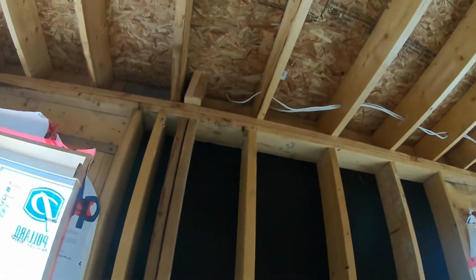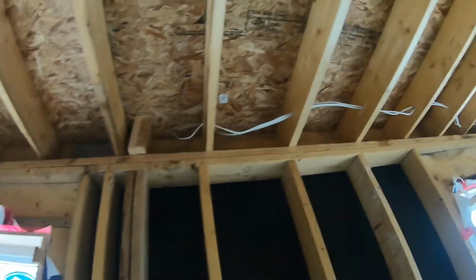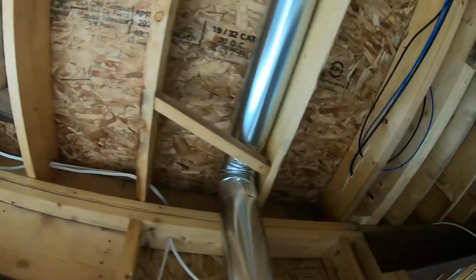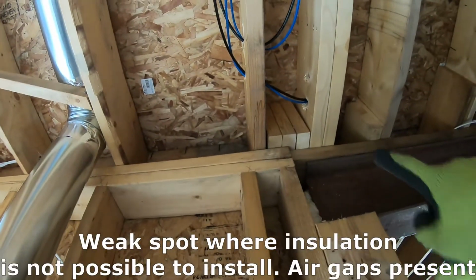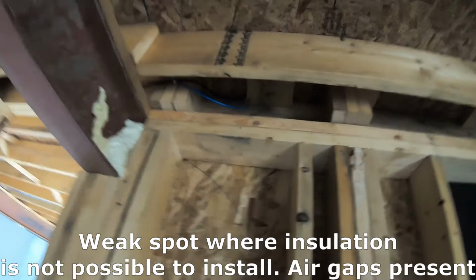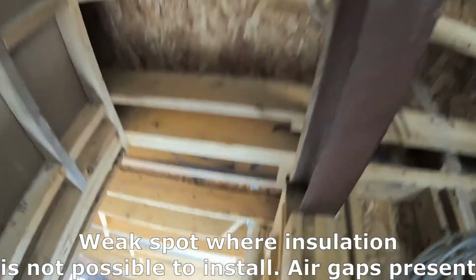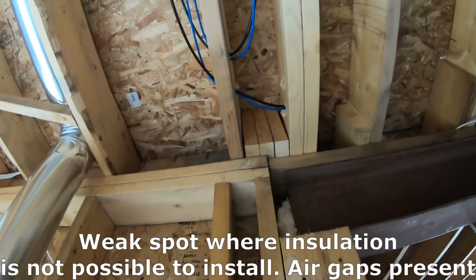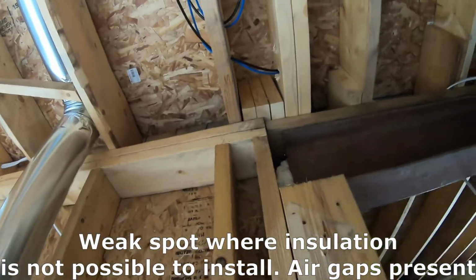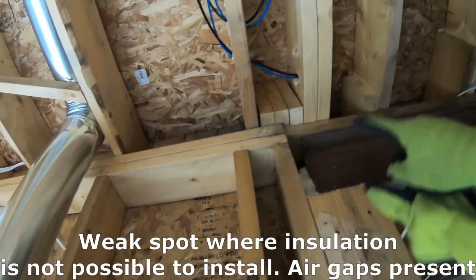So she resists perpendicular flow, but vertical flow is not as good when you're dealing with wires like this. So a lot of people go for the spray foam when it comes to these rim joists right on the perimeter. You can see this is sort of a weak spot here where the framing rested. The triple 2x6, or I would say that looks more like a 2x8 right there, right? So there's not much, and there's holes everywhere. So how do you insulate that corner, right?